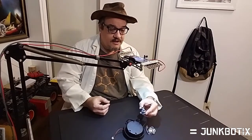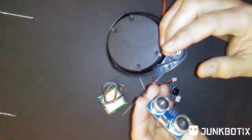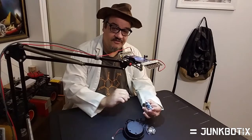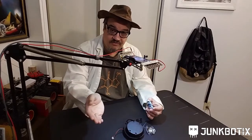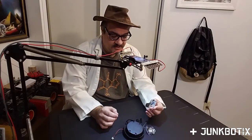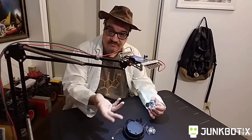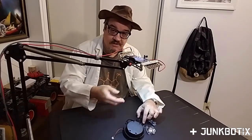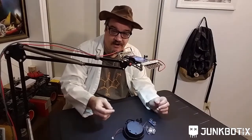Probably the most common one is this ultrasonic sensor. It measures distance — the embedded system sends a signal to it, which sends an ultrasonic signal out, bounces back, and can tell the distance to whatever is nearby. Its biggest downside is probably that soft surfaces don't reflect sound waves very well. So it can't measure certain kinds of soft objects — a hard wall surface would be fine, but something like a pillow would cause problems.